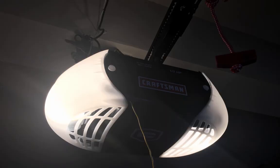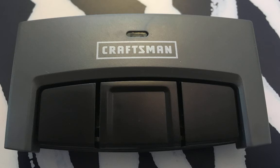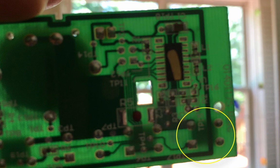Here's the garage door opener after it's been installed. The model number is 139.54915. Here's a close-up of the remotes on the wall, the handheld remote control, and the Insteon on the ceiling. The first thing I did was carefully take apart the remote and held it up so I could see the pins and identify where the connections are — the short, or open-to-close, for the button being pressed, since it's just a single open-close type switch. Once I identified those, I knew I just needed to connect the top one to the bottom section.